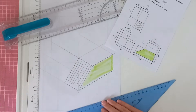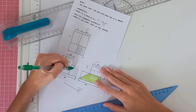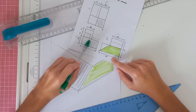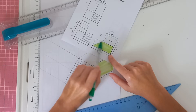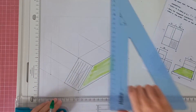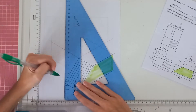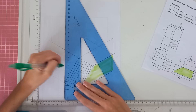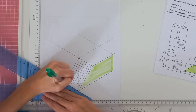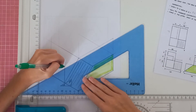The section with the lines forms this part of the slope. Now we've established that this part is also lined because it's the front of the slope if you look from this side. We want to get the rest of the drawing — there's a flat bit here. We know it's flat because the right view shows it flat with a height of 40. We've already measured our height of 40, so we draw that up, draw the line up where it touches the end of the slope, close off the bottom, and close off the top.